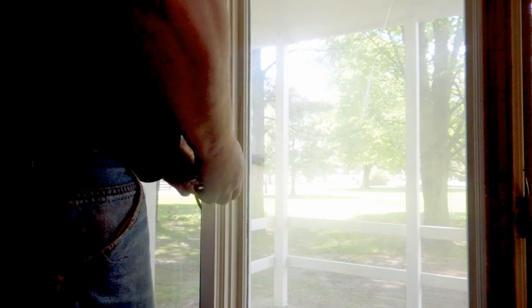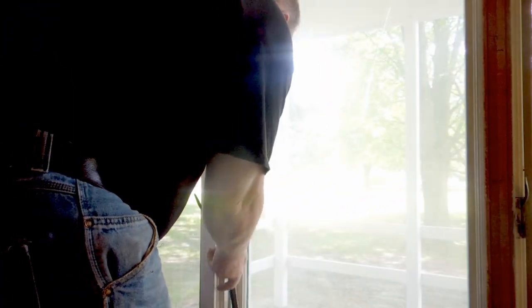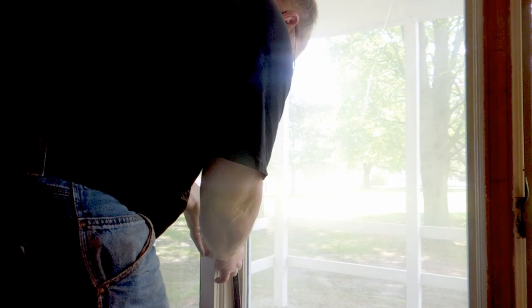So I tapped the boards back in. That caused the finish nails to pop through the paint, and then I could scrape off the paint, find the nails, pull the nails, and then slide the trim out into the room. I couldn't pull it straight up because it was trapped in behind the other trim at the top. This has got to come out inside.